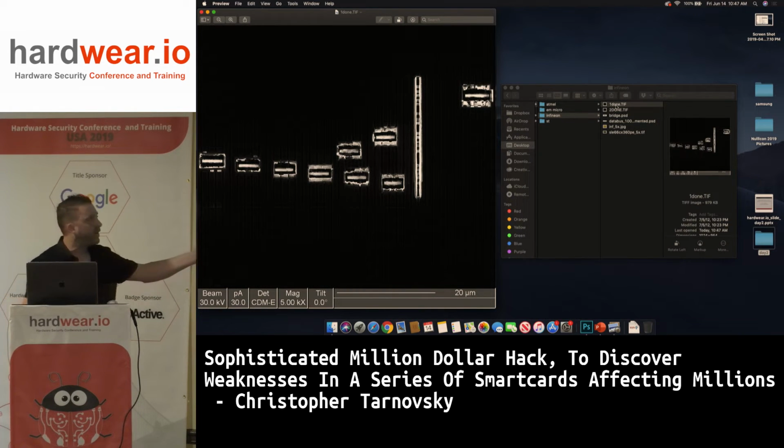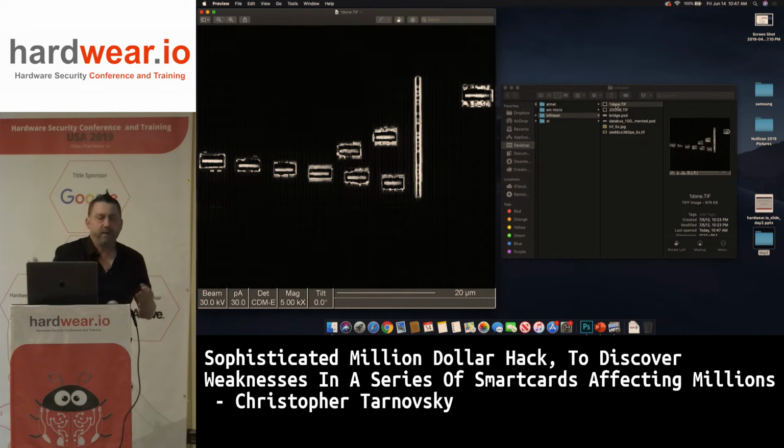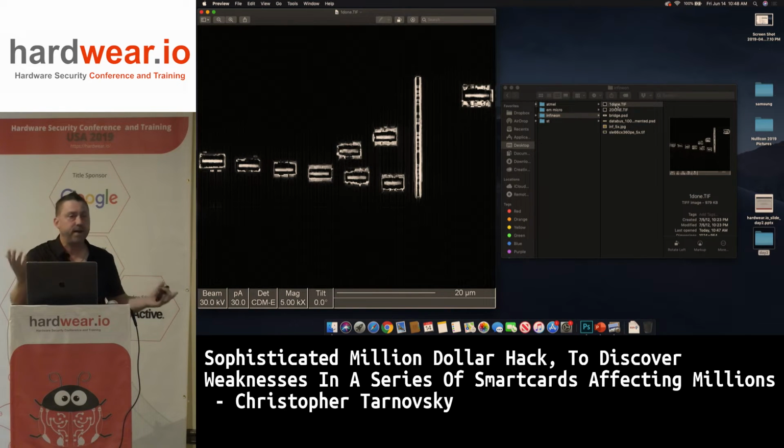Because I can glitch on here, or I could glitch a bit of the data bus. I can change an add to be something else. If it's 21, I can make it 20. If it's 20, I can make it 21. Or I could put a needle on bit 7 and I could OR an 80 into the opcode. So instead of seeing a 20 opcode, it's going to see 20 plus 80. It's what, an A0 opcode? I don't know what it does, but I'm just making this up hypothetically.